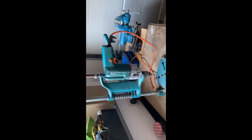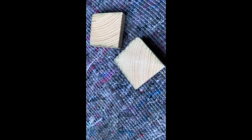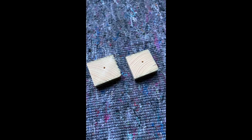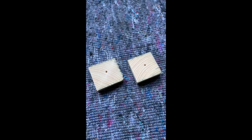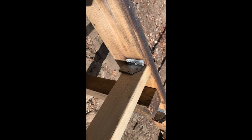I'm going to use the pillar drill here, which I borrowed from my dad, to just drill 2 holes in the middle so that when I screw them in, it doesn't split the wood. Job done. And these will get dipped in wood preserver before I screw them on. You have it, with the spacer at the bottom just rested in at the moment. It is perfectly flat. Superb.